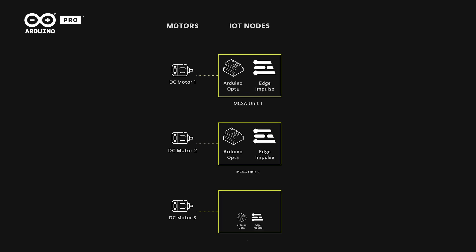Here is how the system is put together. The Arduino Opta WiFi was programmed using Arduino IDE 2.0, and the current sensor is connected in series with the DC motor. The firmware collects data from the current sensor using digital signal processing techniques on the raw signal, and runs the extracted signal features through a machine learning algorithm to determine if there are any anomalies in the current consumption of the motor.